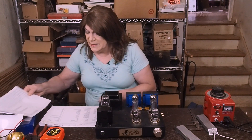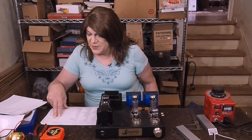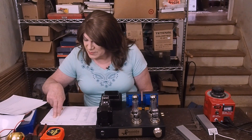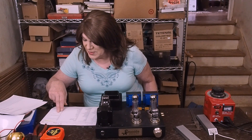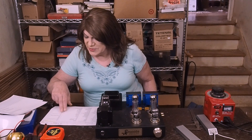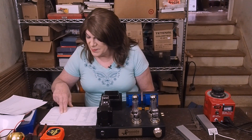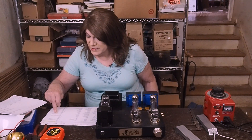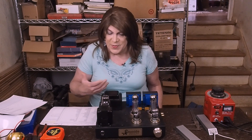Hopefully we can get the cost down closer to $600. If we save $20 on shipping, $40 on the transformer cost, $25 eliminating the one choke inside the power supply, and about $4 net on the capacitor swap - replacing one with a $1 more expensive 270uF cap - that adds up to about $90 in savings on the power supply portion alone, which likely won't be audible.